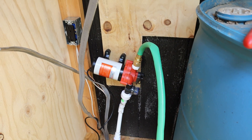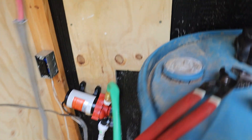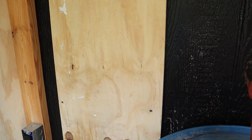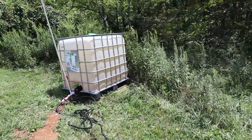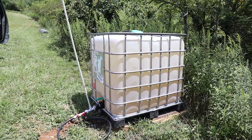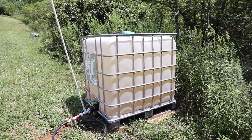As a quick recap, I have the diaphragm pump right here on the wall. It goes down and connects into this barrel. Eventually I'm going to have a hot water heater up here and another house filter, and that will provide a shower inside. This 55-gallon drum is connected to the IBC tote, so I've got a total of about 300 gallons to work with — sufficient for taking showers or washing hands. That's my current goal with this system.